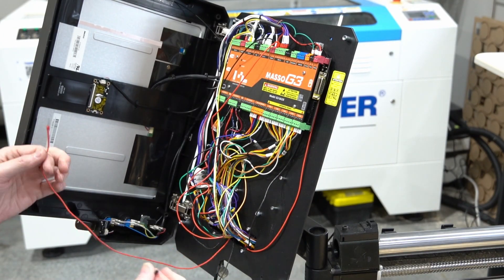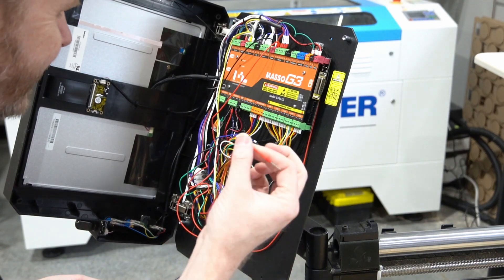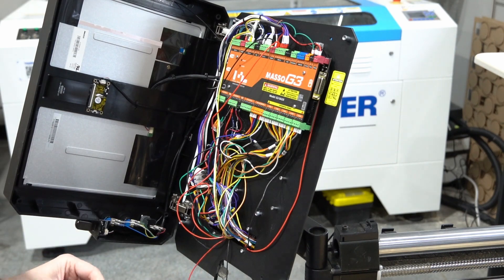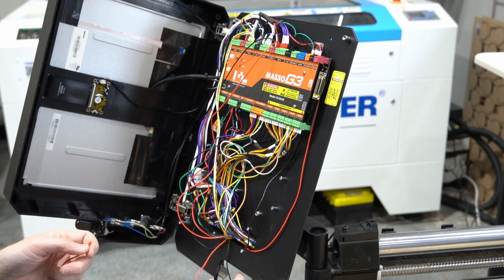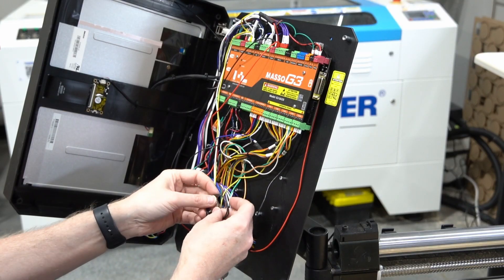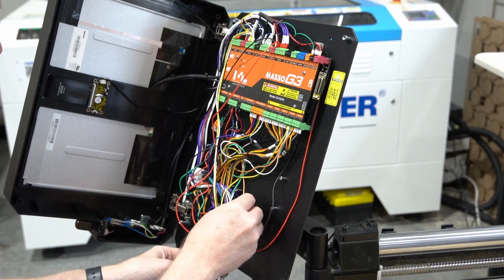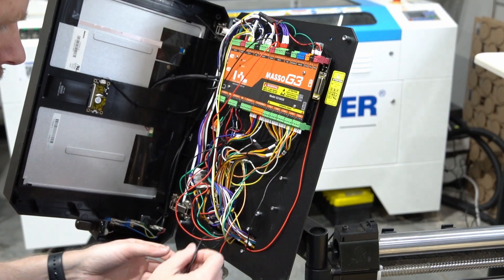The black and the red wires can be used — you don't have to use them all, but you have to use one of them. The black wire is the alarm. The red wire is the enable. So the enable wire is what we're going to be focusing on. You can go ahead and tape off the alarm wire. You will be actively using the rotary, so the alarm being unmonitored isn't really that terribly important — we can wire that up later. For now, you can just hide it, tape it off, and keep that out of the way.